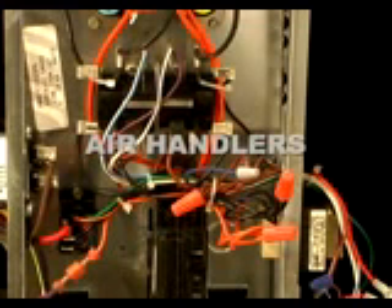The most common problem you have with these air handlers are the relay, the blower motor relay, or whatever type control it is. It may be a little time delay, solid state thing or something else, but they either fail to turn the motor on or they fail to turn it off. And then the transformers fail fairly regularly.